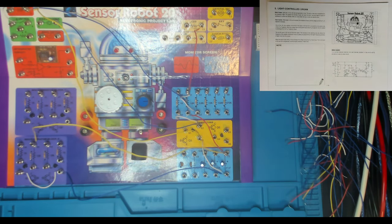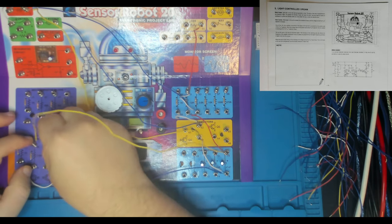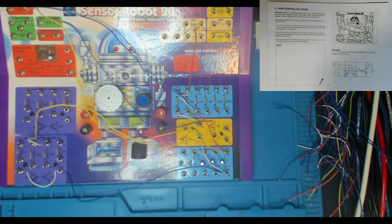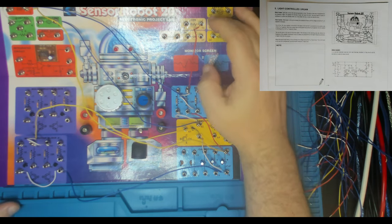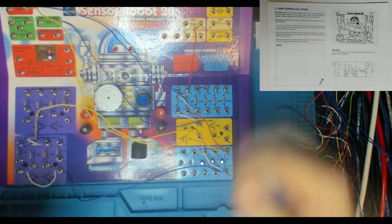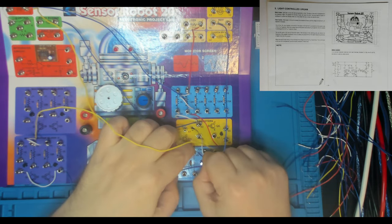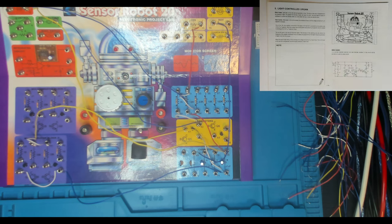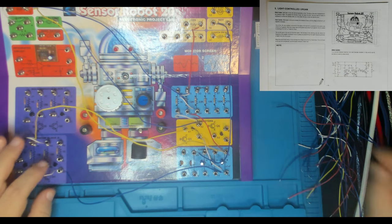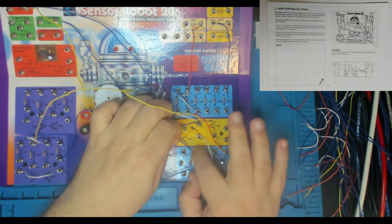And then 40 to 44. Okay. It's connecting our transistors via the resistors. It's 40 to 44. Okay. And then we've got 16 to 69. So 16 is our key. And 69 is one of our ceramic capacitors. There we go. 16 to 69. And after that, we've got 69 to 47, connecting in the collector of Q4. Collector of Q4 is 47. And 69 is our ceramic capacitor.